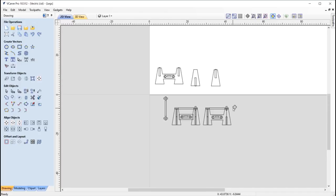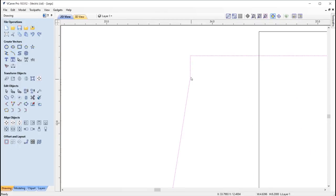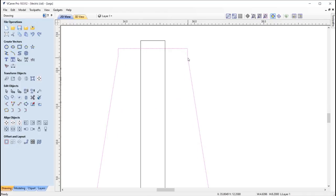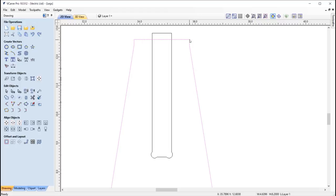Now, I'm kind of talking about this after we've actually machined it. And there's one thing that I noted, which I've changed, and I have tweaked some of the vectors for you in your file, should you want to go ahead and do this. Now what that is, is just the straight flat part. So I had a flat of 0.2 that goes into the base of the actual laptop stand, which is fine, but it turned out when we were sanding it, it was a little tricky because it's such a small value that in areas we had maybe sanded too much, and so it created more of a diagonal. And so when we inserted some of the legs, it's a little bit wobbly because we didn't have a defined vertical to actually slot inside.